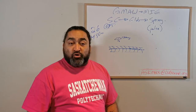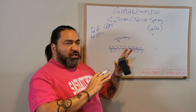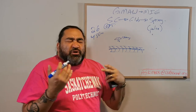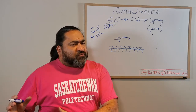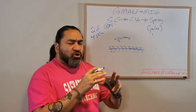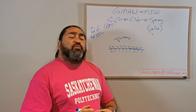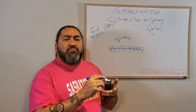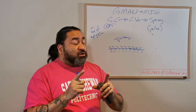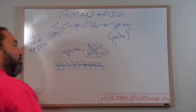Now, I generally and personally, professionally, don't like that. I can do it sometimes, but I only do it if I'm really looking for a visual output. Really, in my professional life, I'm not so concerned with visual as I am about quality. And I want quality welds, which means I like a nice, steady, no screwing around type of weld. But if you want to make it pretty, go ahead and make it pretty. But realize that you may be compromising some root penetration, because any motion like that is transferring your heat current, your line of current, every step you're screwing with it. So be careful.